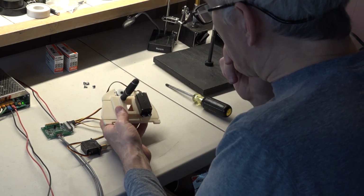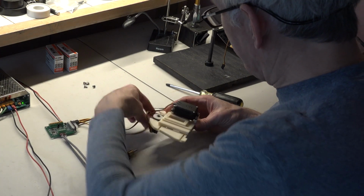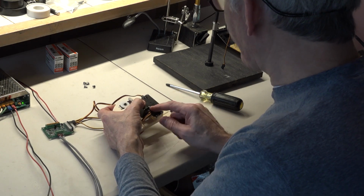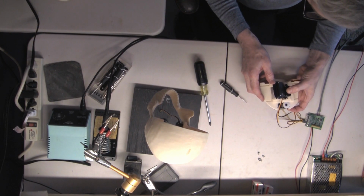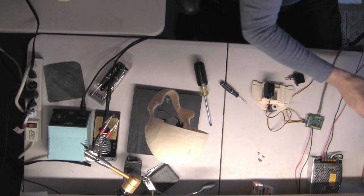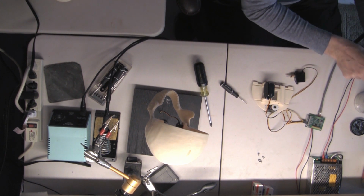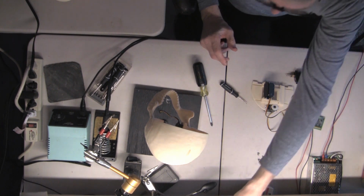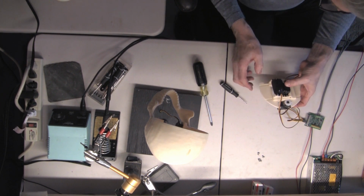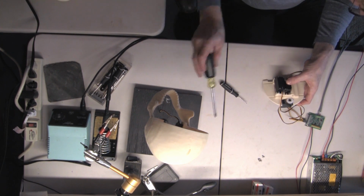Okay, now the last one is going to be the top, the rotate servo. And that one, this part towards the front. And you notice it comes very, very close, almost hitting, possibly even resting against this servo. So another thing that I do with that when I'm doing it is I get a little bit more grease and just put it on the side of the servo. That way, if it does brush against this other servo, it's like less than 1 millimeter apart from it. Probably a 0.5 millimeter apart. But if it does bump up against it, it'll reduce the friction down to practically nothing, and it won't have an effect. So I'm doing that.